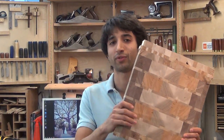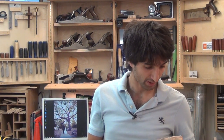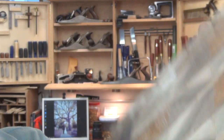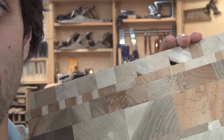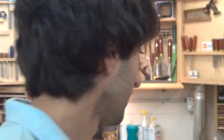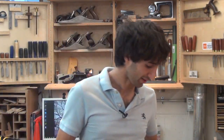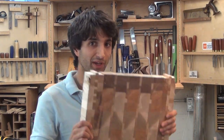The other thing I wanted to show you from the demo last week was the cutting board that I sent through the planer. I had some questions about the surface quality and the tear out, so I just wanted to show you that on camera. This is not going to be finish ready — there is quite a bit of tear out and things that need to be cleaned up, so this would probably have to be sanded anyway. I had a little burning there. But overall it's a pretty decent method. You just really need to wrap the boards for this to really work, but yeah, this needs a little bit of cleanup before getting it finished.